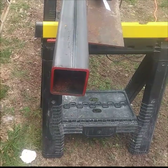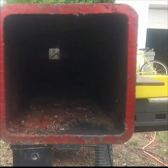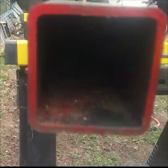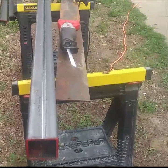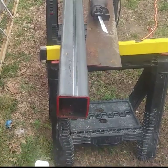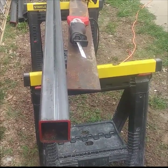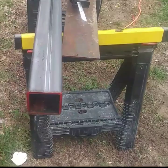If you look through this you'll see all the way down the other end. Here's the thickness of it — it is a quarter inch, it is very very heavy. This comes in a 10-foot length. I have varying lengths here; it's a small basement, my highest post is 75 inches. Everything else deviates a quarter inch plus or minus. The idea is to put something that's positively solid, something that can't be kicked away, something that's more than beefy enough to support the load of living room furniture and live load.